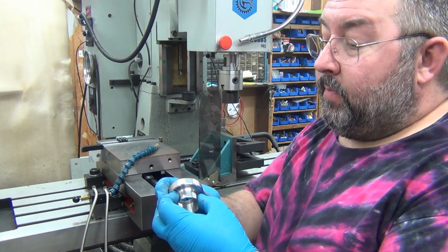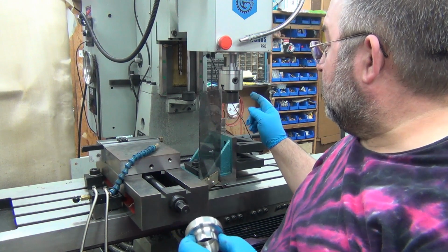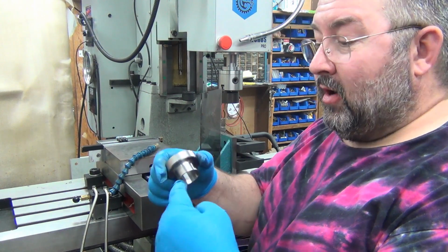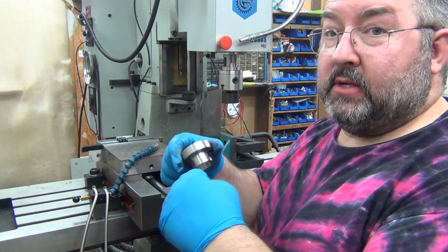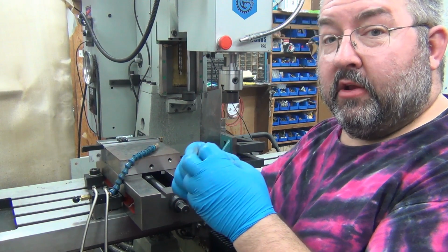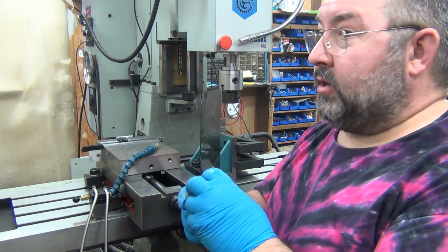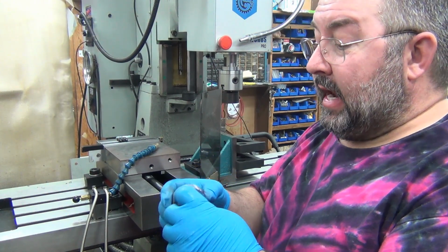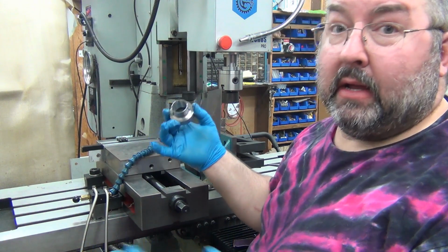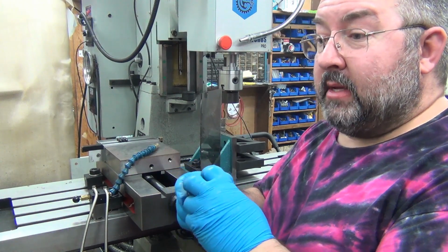So I've been cutting them at 0.008 inch per revolution, which is half of the nose radius on both of these tools. For RPMs, what I did was I went through for every cut and figured out the RPM for 780 surface feet per minute. I went all the way from 600 to 1200, and 780 when I got everything dialed in and finally got it to where I wasn't getting any chatter, which I started picking back up. I'm going to assume it's the insert getting dull there. Anyway, 780 seemed to be the target range.